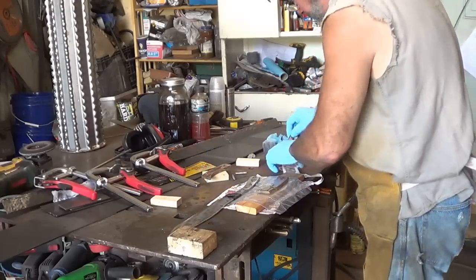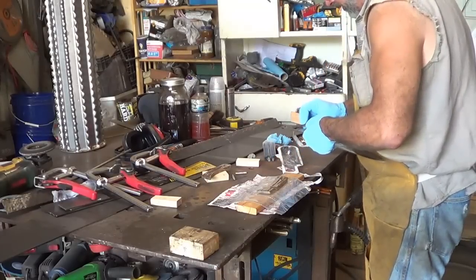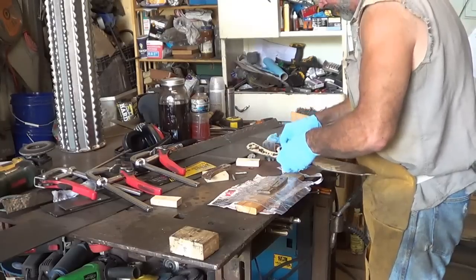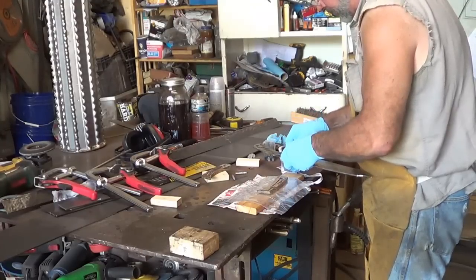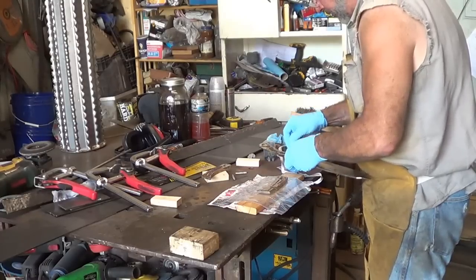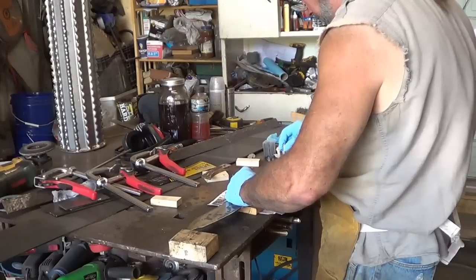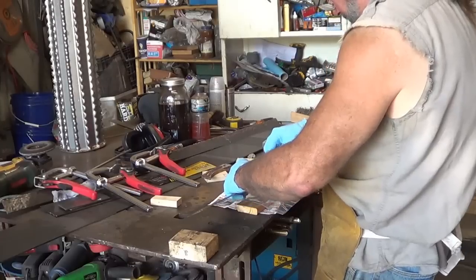Set you off to the side and we'll go ahead and coat the knife. Push down below and coat it. Both sides. With these grooves from this file, it'll hold the epoxy well. Alright, that's the end of that. How's my time going? Go ahead, put some epoxy in that pin.